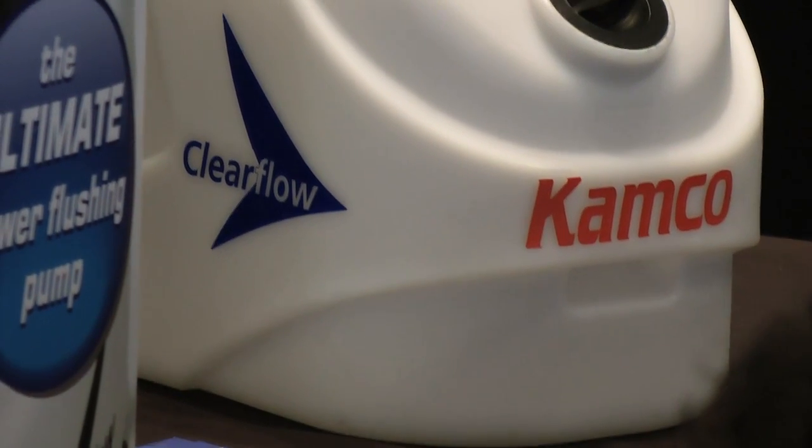I don't know whether you know it, but I suspect all of us here are in hard water areas because of the catchment area of the show here. If you put fresh clean water on a heating system and fire the boiler, most of the hardness salts are out within the first couple of hours. And of course where they tend to come out is on the inside of the boiler, so you're going to have an efficiency loss straight away. So it is important to put your inhibitor in quickly.